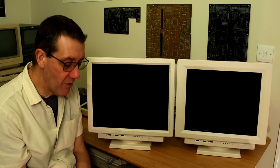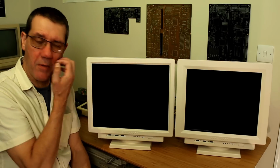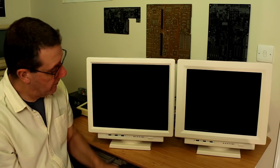Now it kind of raises a concern, because when you turn on standby, what it does is it turns the controller into low power, very low power mode. You know what standby does, but unfortunately standby doesn't go to all the other boards internally. So probably not going to have a standby mode on this. I think what we're going to actually do is you power it off, okay? Because there's no reason you'd want to leave it in standby mode, at least I don't think there is. And so when you turn it off, it will power everything down inside, and you'll do it by that button.